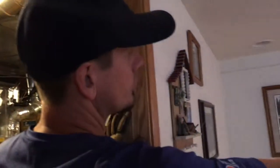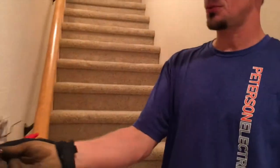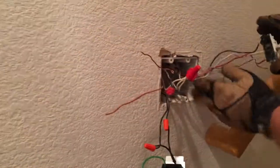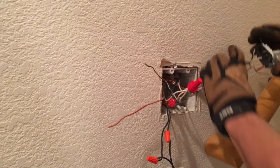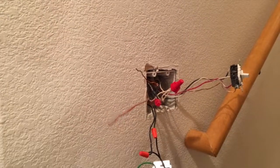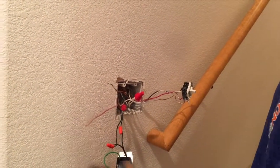The original wiring had a red-capped wire. Just because you open a box and see a red, don't assume that's automatically a three-way switch. This is a dead-end three-way — these four wires have nothing to do with this basement. That red could be a switched outlet, a track light, or a switching back-loop to the lights in storage — which it was. So they cut it off and shoved it in.